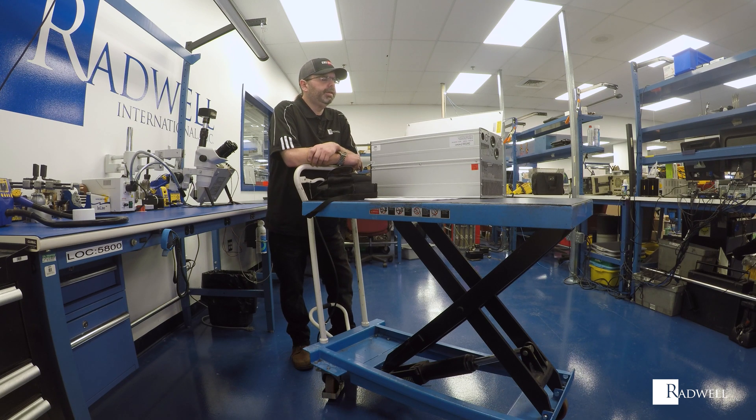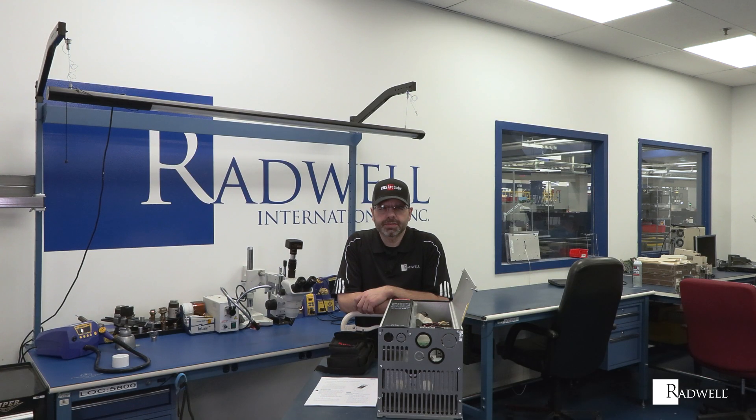If your facility has a lockout/tagout safety program, make sure that's in place — breakers are locked out and tagged out. Also, notify somebody that you're turning power off, so nobody accidentally thinks a breaker tripped and turns it back on while you're working on the equipment.